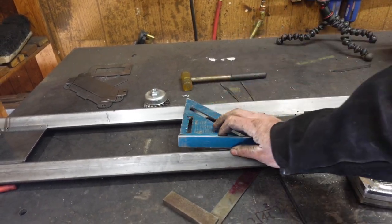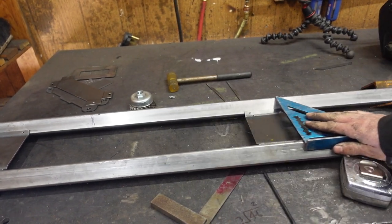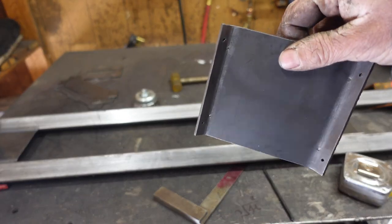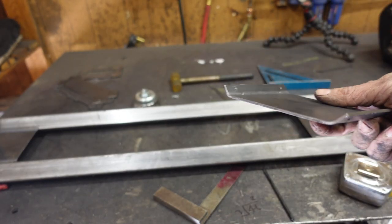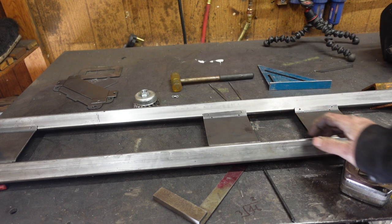It means that I have to build the Z-axis first and then I'll stick my bearings on accordingly. I've got my two rails set up and I'm checking with a square all the way along — they're pretty dead nuts. We have these spacer blocks that I bent earlier ready, and these are just going to lay right in there and I'll weld them in place.